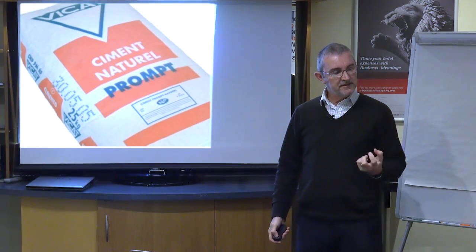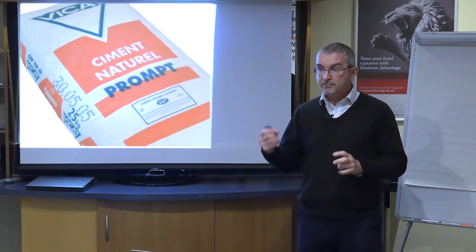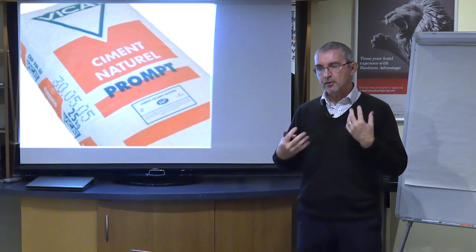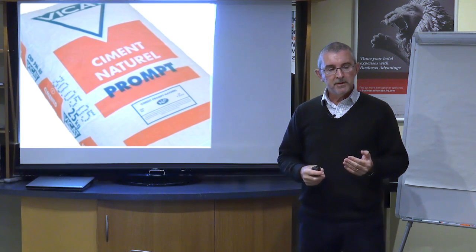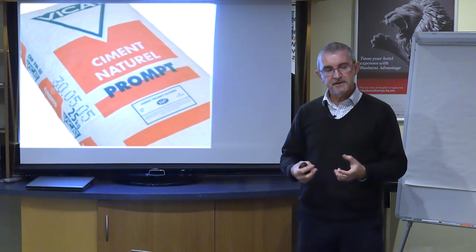You can slow that set down by using citric acid. So I said to you, it goes off really quickly. I mean, under a minute. You can retard it if you put some orange juice in it or citric acid. You can get up to about 10 minutes by putting a little bit in, you can delay that set. But essentially, you've really got to know what you're doing with it and why you're using it.